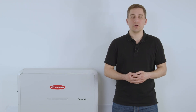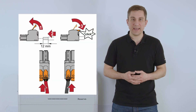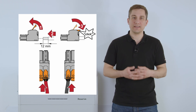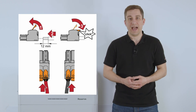To connect the DC cable to the inverter, find the extra contact on the hybrid inverter labeled BAT (for battery connection), and directly connect the DC plus and DC minus cables coming from the Fronius Reserva to the Fronius Hybrid Inverter.